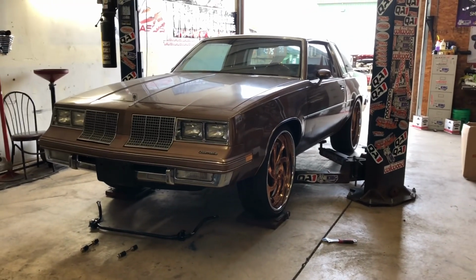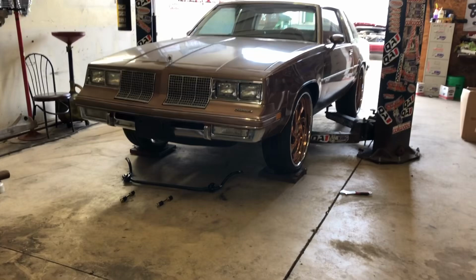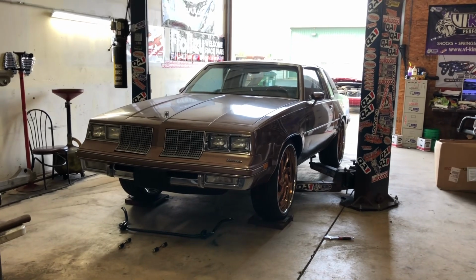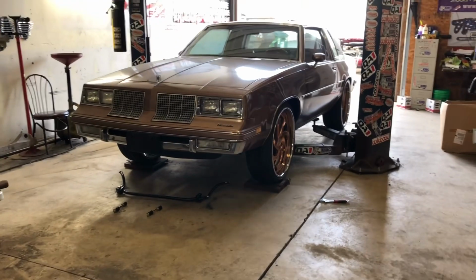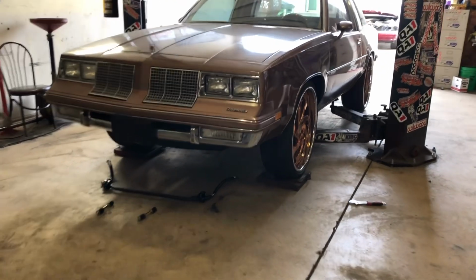For these, sometimes when the wheel is so straight up and down in the front, perfect, that it's a little off from the back, so it makes it look like it's sticking out at the top. Because over the years with a stock rear end in the back, the axle tube bend a little, and the back wheels actually have just a little bit of camber to them, negative camber. So sometimes if I set the wheels too perfect in the front, they look like they're out at the top. But anyways, that's all set up.